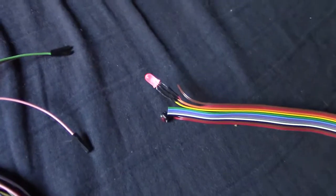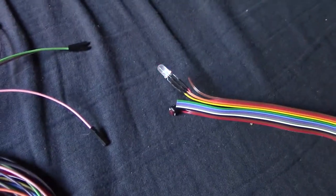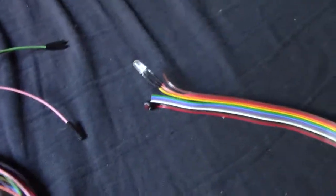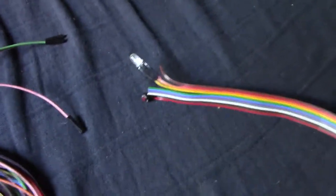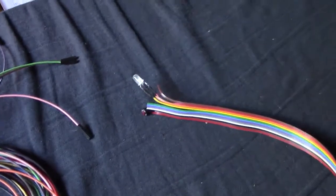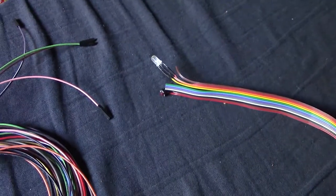And now, again, let's remove power. And I've already got the bleeder resistor on. 1001, plug it back in, it's green. You're not getting red anymore. Why is that? That's the bleeder resistor. Pretty cool, right? A simple resistor actually could solve my problem.